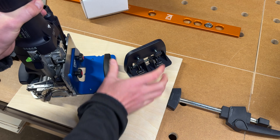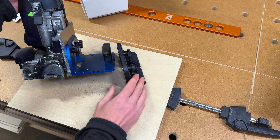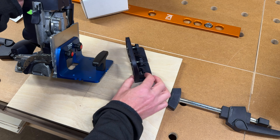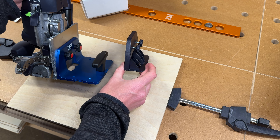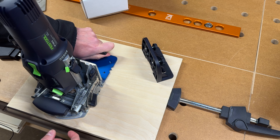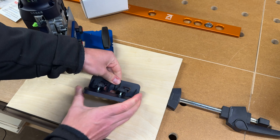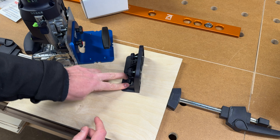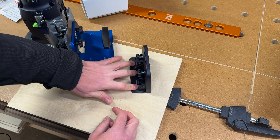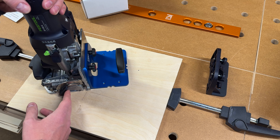You can see it here — just the difference, not just in the surface area, which is approximately double on the TSO Bigfoot. It is just under 12,000 square millimeters, whereas the Festool support bracket is just under 6,000 — so more than double the surface area. But not only that, you get this T-handle, which just gives you that ability to hold the whole system so nicely, whereas the one included from Festool meant getting your fingers in there, close to the cutters. I just never felt comfortable and felt like I was going to slip. That stability is what is absolutely amazing about this.